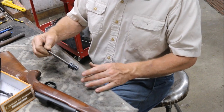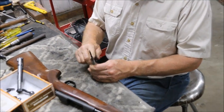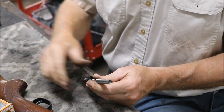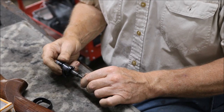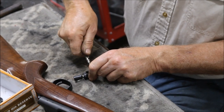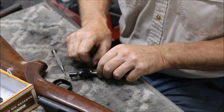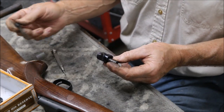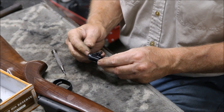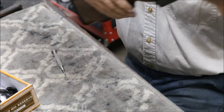We're going to polish the bolt so it all looks factory when done. We have to dismantle the bolt — the firing pin — and to get that out there's a collar on these firing pins that you push down and give a 90-degree turn. When you do that the firing pin spring comes off. I don't take everything out when I blue them; I leave the safety in and cook it out in the ultrasonic after, because they're hard to get out and back in. When I take that one screw out the firing pin comes out, but I'll leave a few difficult parts in. If you ultrasonic it after bluing, the plungers and springs will be cleaned out and you'll be just fine.